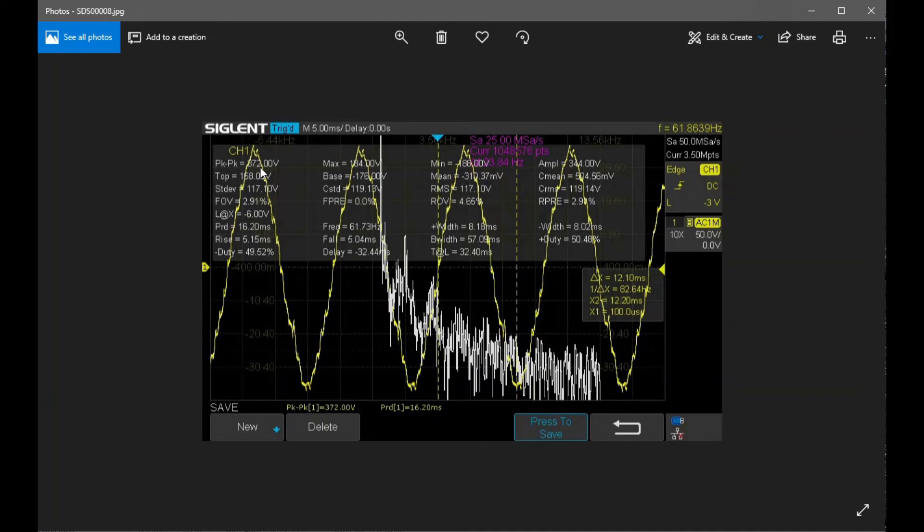I don't really have a good way to measure the impact of that defect on other electronics such as a laptop — I didn't want to risk plugging anything into that generator with that known problem. But now this is a pretty good waveform for a portable generator, quite honestly. I think it's better than the Black Max that we measured in the previous video, definitely better than the Coleman. Of the three generators, I think the Elite 8000 with the correctly operating AVR is probably the best one. I hope this was helpful — if you guys run into a similar issue with your generator, like if you plug in a kill-a-watt or a multimeter and see the frequency through the roof, then look at the AVR and have a look. Hope you found this video helpful. If you did, subscribe and stay safe.